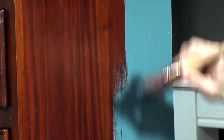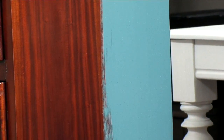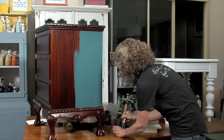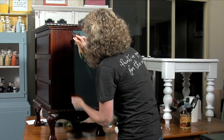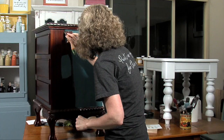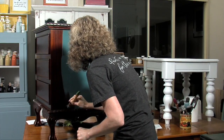The colour won't be a true colour until it's dried — some pigments actually look a little bit darker when wet. The angle of your brush is important: 45 degrees is usually what I do. It's sometimes easier to lay a piece on its side so you're painting horizontally. We're laying the paint on, not pushing it — because if I'm pushing, I'm squishing and creating more brush strokes and lines. A lot of these tips I learnt from the pros, Jenny Lynn and Laurie themselves, the wonderful owners of Fusion Mineral Paint. Thank you so much for letting me do this live today.